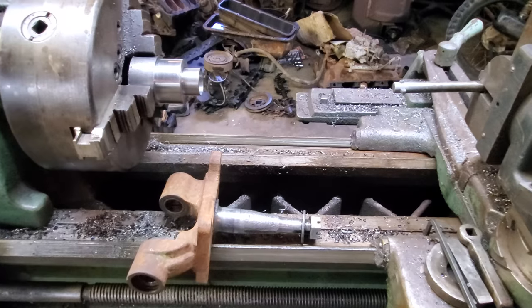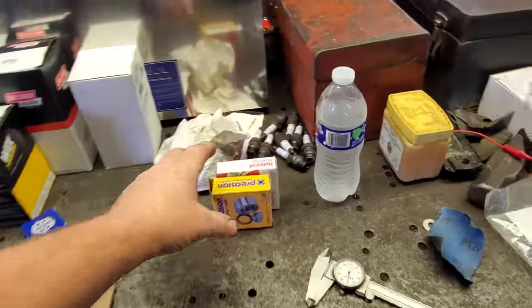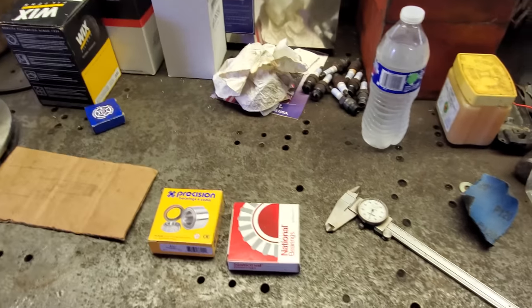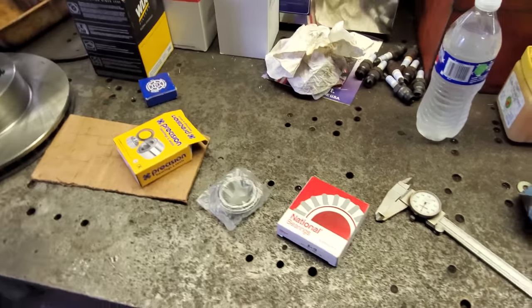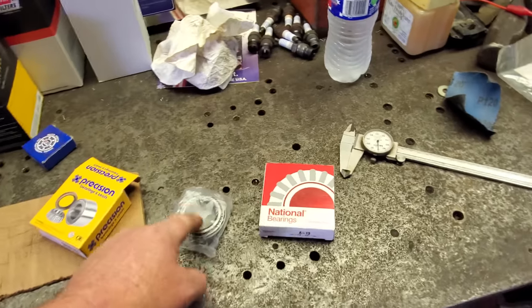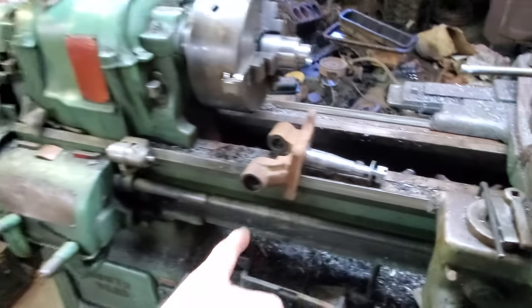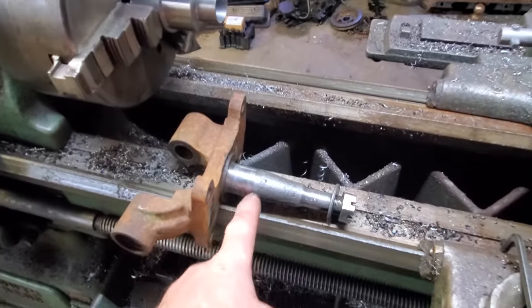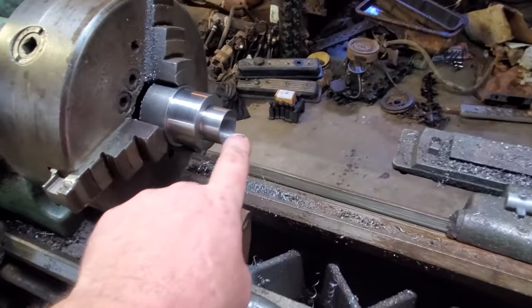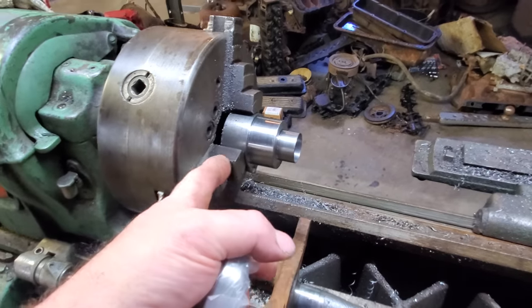I went home and did a little studying, and I came across the instructions for this kit I'm copying. Reading through the instructions — remember me telling you they probably use a different bearing? That's exactly what they do. I just went and got it. It comes off a 71 through 80 Pinto or Mustang II. This machined surface is an inch and 187, and the bearing from the Camaro rotor was an inch and 250 — that left 30-thousandths. This new bearing is an inch and 377. That's 190-thousandths difference, leaving a 95-thousandths wall — much better than 30-thousandths. I believe that'll work. So I've got to unchuck this, pitch it in the trash, and start over.